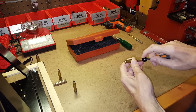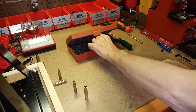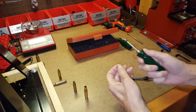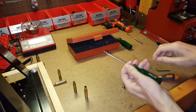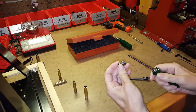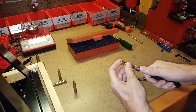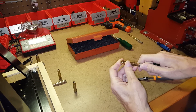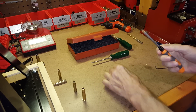With the universal-style tool, the cone-shaped indexing piece will fit regardless of caliber — the case neck meets the cone at some point and it doesn't matter what caliber it is. With a bushing-style flash hole cutter, you need to get the appropriate bushing for the caliber you're using. This is a 30-caliber bushing — it fits over the shaft, and the bushing itself then goes into the mouth of the case. With the universal style you just use this cone-shaped device and it fits any caliber.